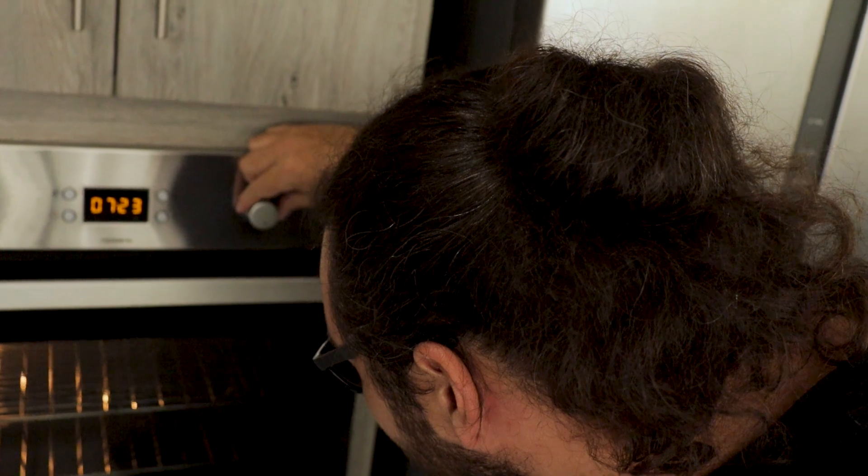We're actually at my dad's house because his oven is just a little more reliable than mine. The first thing we're gonna want to do is head on over to the oven and set the dial to provide heat from both the top and bottom. If your oven has a fan function to evenly spread the heat, you can probably leave that on — but if it blows especially hard, leave it off because it can move around the components on the PCB itself. The second thing you're gonna want to do is set your temperature to around 370 degrees Fahrenheit or 190 degrees Celsius, and then let it preheat for about 15 minutes.